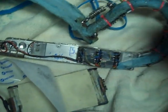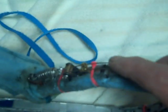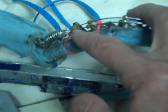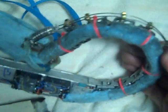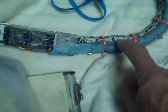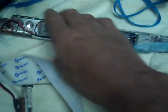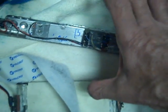If you care to build it, these are brass eyelets right here. Actually a bolt I had flattened and I drilled holes into it. And everything's on a swivel. You need it to be on a swivel. There's about 8 parts per vertebrae here. There's about 8 of them altogether, and then plus the 2 main body supports. All this is hidden inside the tail, and the tail's bulk hides the whole thing.